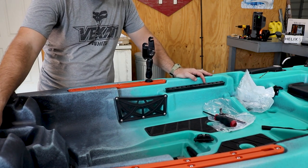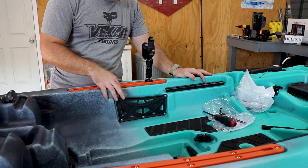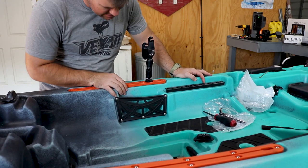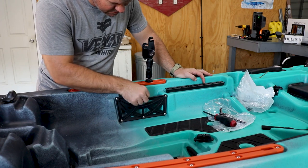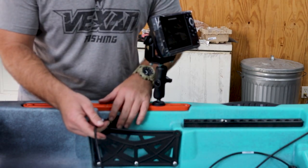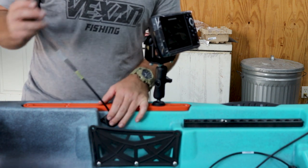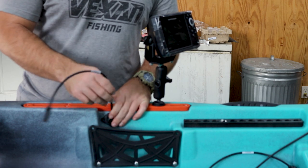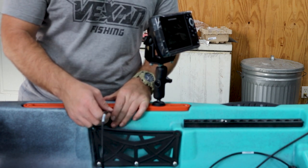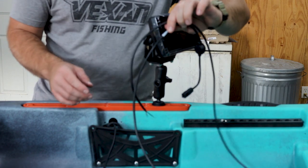Those through-hole fittings are flush-mounted, so there's not a whole lot to get in the way. I'm thinking maybe right here in this corner — it'll come out and hook up right here in the back of the unit. I'll give myself a little bit of slack so I can tuck the wires inside there, or just have it run up the back right here. I ended up putting my hole up here, went ahead and put my through-hole fitting over here, and got my transducer cable out. I'm going to leave myself a proper amount of slack so if I wanted to slide this thing back I've still got room. That rubber on there is tight, but not so tight I can't shove some of this cable back in or out.